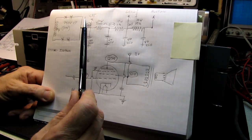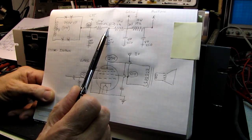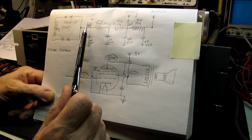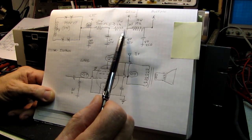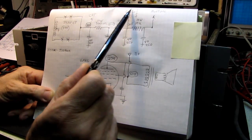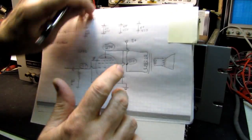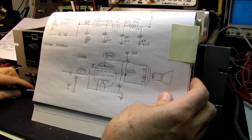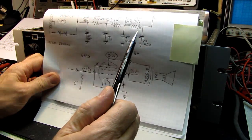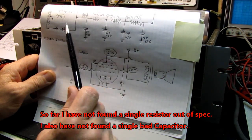We go through a 500-ohm 10-watt resistor — that's spot on — to another 40µF 450V capacitor where we have 410 volts, a much more reasonable voltage. The drop across that resistor brings us down to 410. That 465 volts, however, concerns me. Then we go through a 1k 10-watt resistor and we have the tap where the 6AK6 audio amplifier and several other tubes are fed — it goes all over the radio — and that measures 305 volts at that point.